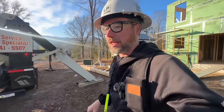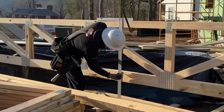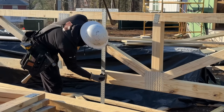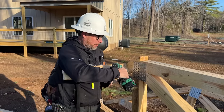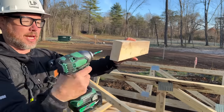This is our first truss and it's a girder truss, so Jamie is smart and marking the layout of all the other pieces that are going to land on the girder truss while it's still on the ground. I'm also getting some spacer blocks screwed to the side of this truss so when our next one comes in we've got a positive registration and can tack them together.